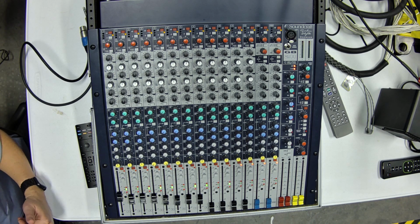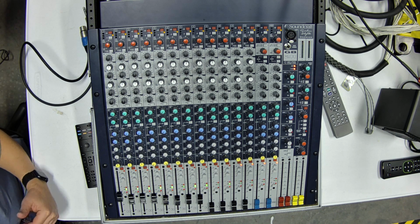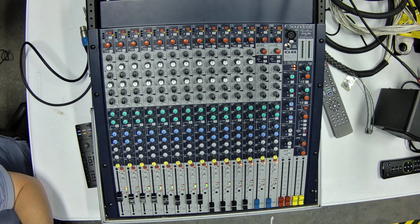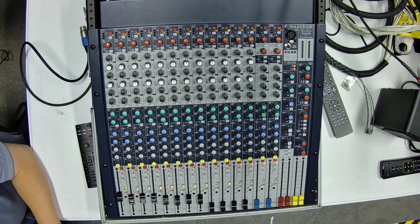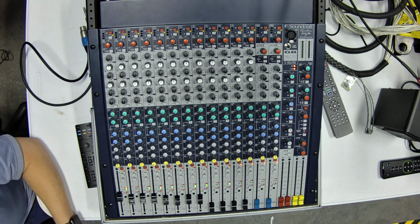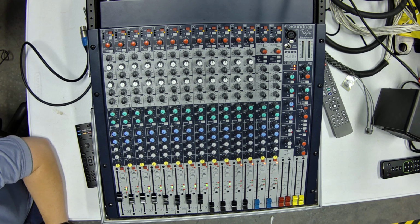So now, how do you fix that? If you've got these two mics working in opposition to each other, well, you could turn one of them off, not have it running through the mixer, and then they're not going to fight each other. But maybe that other mic is picking up something that you want. You could try to move them, right? Or you could just invert the polarity of one of those mics. And now they're working in the same direction, right? They're both doing the same thing together. And now they won't be canceling out when you mix them together on the mixer.